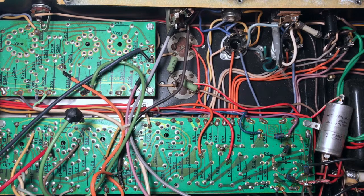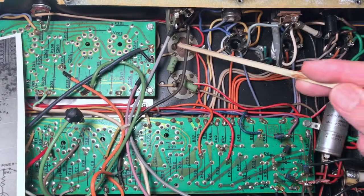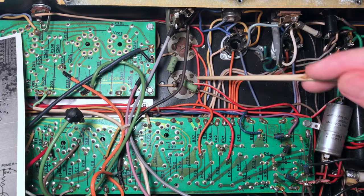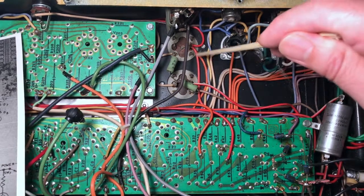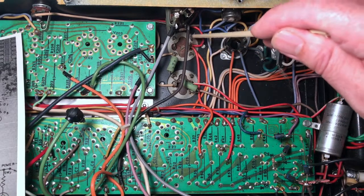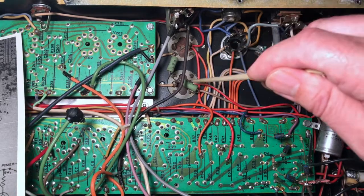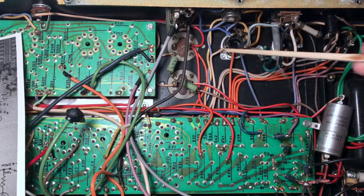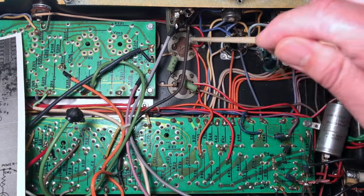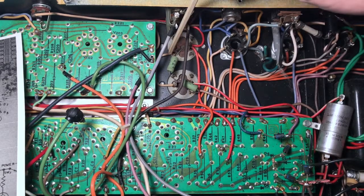But certainly what's important to realize is that if you are replacing these capacitor cans with discrete components, you cannot ground them to the chassis somewhere around here. You can see that these two cans are isolated from the chassis. There is no connection here with the ground structure of these. And since they are in series, this cannot be connected to the chassis at all, because this point here in this canister is not 0 volts.